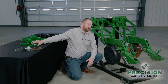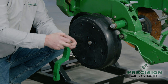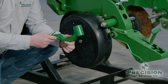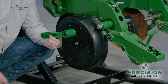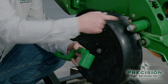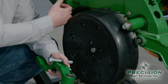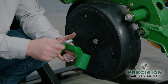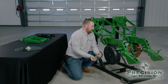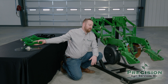There are other options out there. For instance, I have on display a GBGI gauge wheel arm — a double roll, single roll bearing style arm. It is completely greaseless, so it's maintenance free. The arm is hardened, and the way you set it on the row unit is with the same bolt and a washer style to shim it out. A lot of operators have enjoyed the much less maintenance, and the bonus of changing double disc openers without getting grease all over your hands.